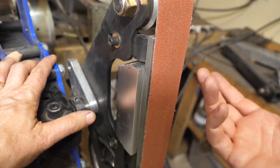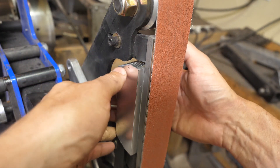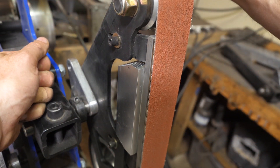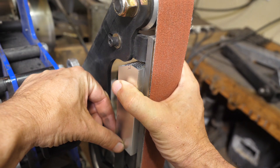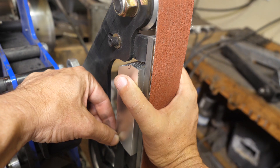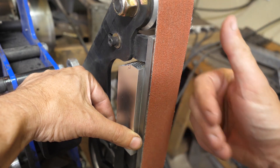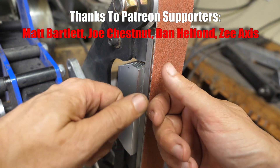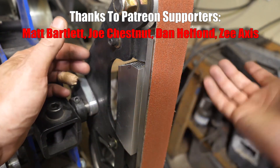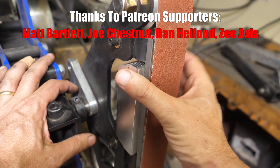What a great experiment — that was a lot of fun. I wonder about flushing this up with the side of the platen so you can still get in here with a file guide or a grinding jig. Closing it up with tubes running over the side so you can still take the belt on and off — air in, air out, all closed up. Maybe you could use water, which would probably be more efficient, but then you'd need a pump and risk leaks. I don't think anything will necessarily come of this, but it's really interesting that the platen got a lot cooler, even though it didn't mean you could keep the knife against the belt a lot longer. There's much more thermal mass in the platen than in the knife, so even at 130 degrees the knife at its smaller mass is probably taking on more heat. Interesting experiment — I hope you guys enjoyed it. Take care.